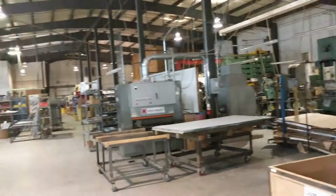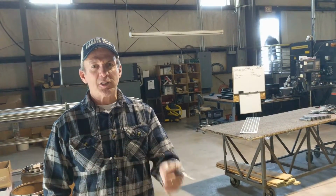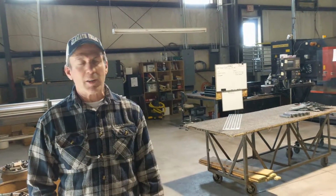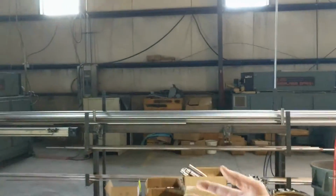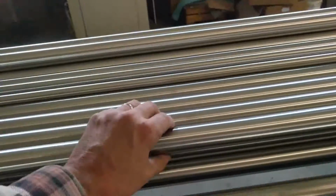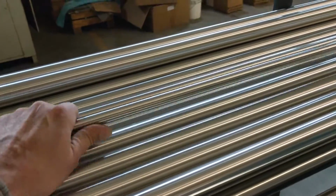All our flat sheet, all our tube, stainless tube, titanium tube that's straight, comes in here, and then we start cutting to length and shaping the flat stainless into the punch presses over here that are all for the dies and that sort of thing. Laser cutter over here behind me for notches. I was watching this earlier, and all these tubes, which was it? These little tubes are getting sliced and diced into spray jet manifolds. These are 1.5-inch wands, inevitably. This will be a manifold. It's probably a handle.